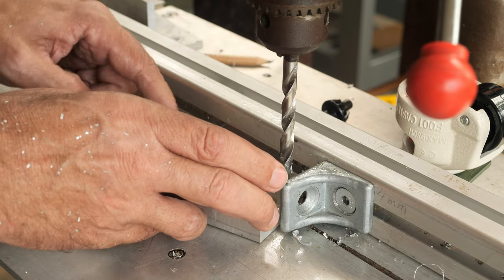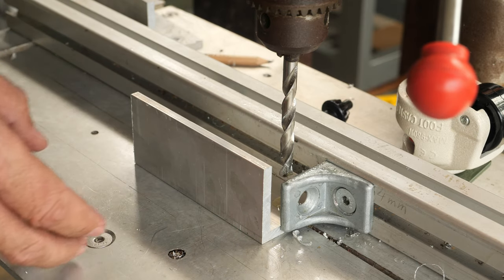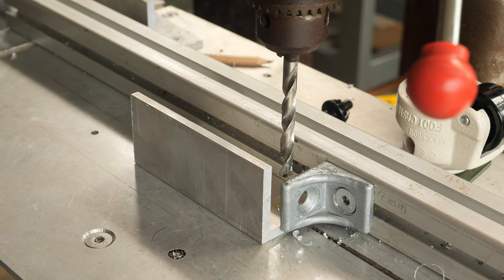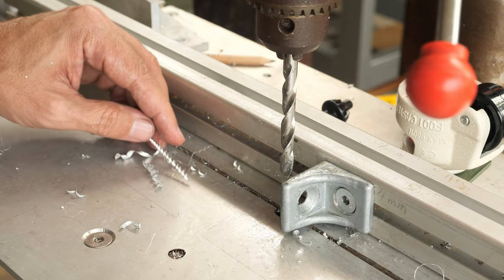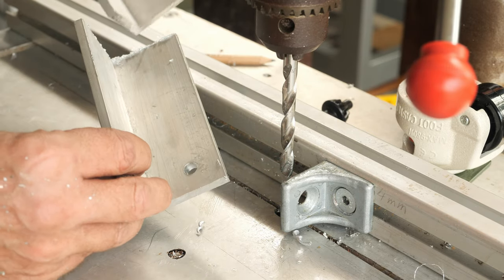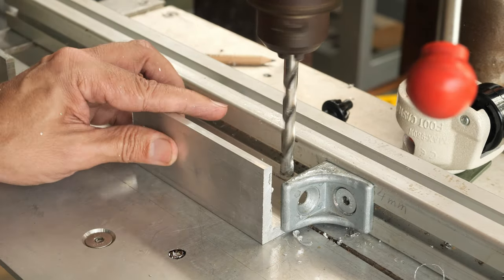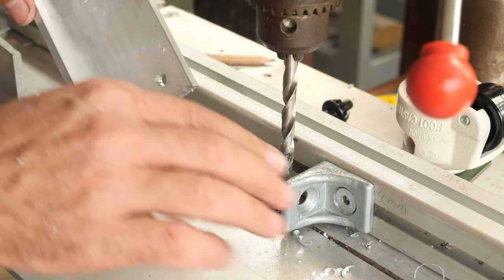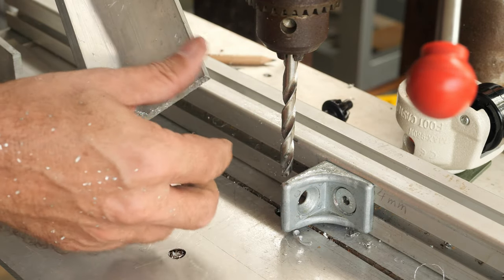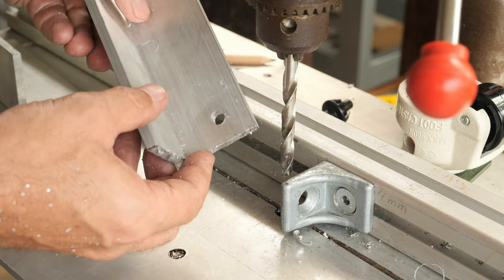If you remember to use lubricant — or coolant, I'd rather call it — your drill bit will remain sharp. I'm using a Bosch quality drill bit, which saves money even if it's a little more expensive upfront; you can use it ten times longer than cheaper imported drills. I really like this kind of chips because I know it's cutting the material, not grinding it. The holes are very crisp. When you apply proper pressure and RPM the drill bit doesn't even get hot. When you grind through the material you get overheating and melting. This technique is really effective.